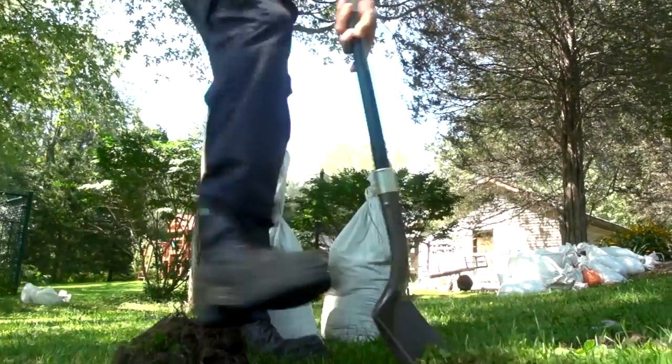What happens if we bring the wall out too far? Let's say everybody in the neighborhood brings their wall out right next to the river. Well, the problem then is we're taking away floodplain, because at the end of the day, the river has to outflow its extra capacity. If we narrow the walls in, we're creating an issue for someone downstream, and for people upstream. So it's an hourglass effect. It's going to cause a bottleneck at the top, and issues down below as well.